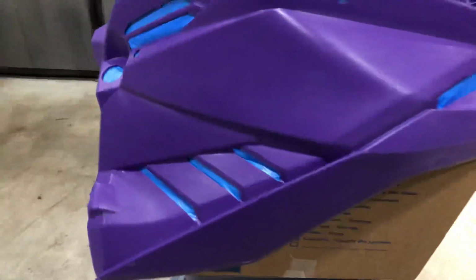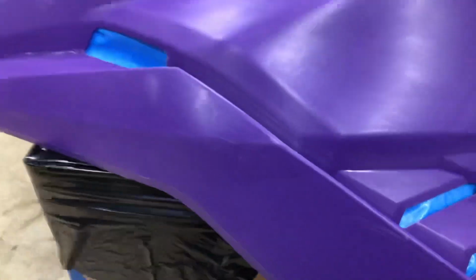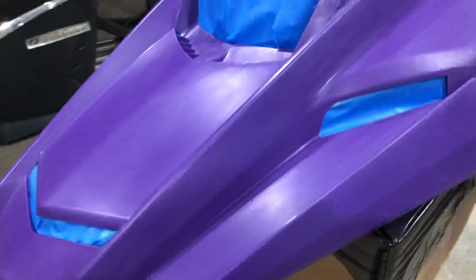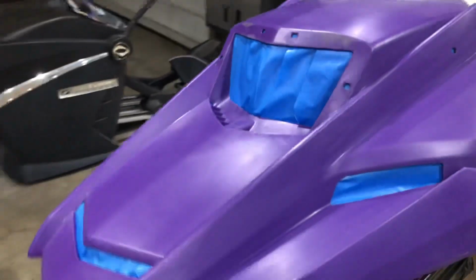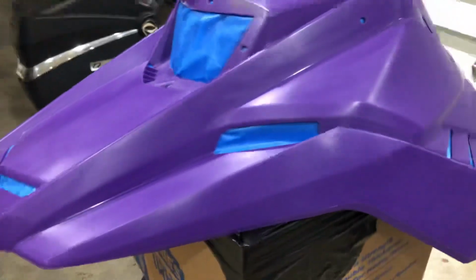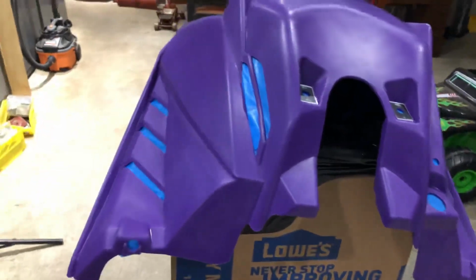And then it left a bunch of almost like plastic sawdust from cleaning it, so we washed it again with soap and water. So we're pretty well dialed now. I'm going to go over it with a tack cloth and get the last of any little fine hairs or other things that might be on it. And then, to make sure that when we paint you don't get blowback paint coming through, I put masking tape on the inside of any of the openings, to help make sure all the paint went on well.